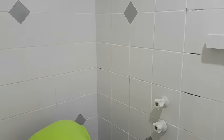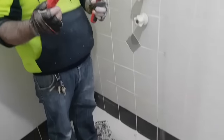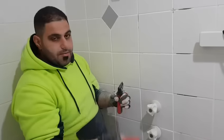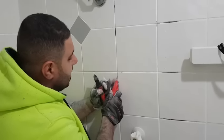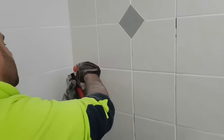If you are not going to use a power tool, you can get hand ones available at your local Bunnings — they come with a diamond blade similar to the power version. I generally go back over the job with the hand tool just to clean up any rough edges and especially in corners where the machine can't go.